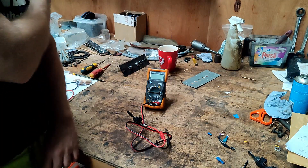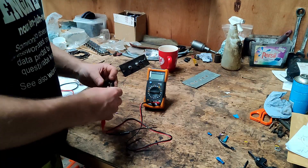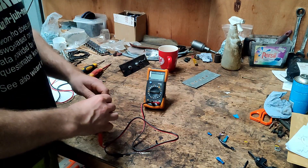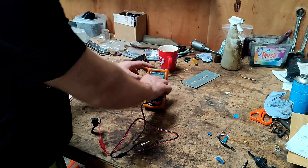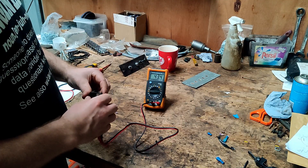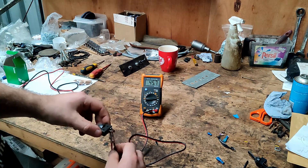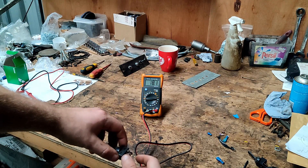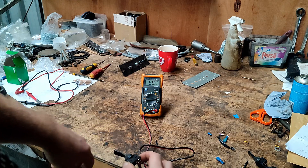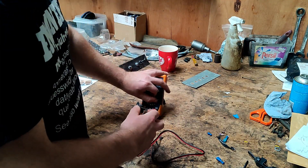Another thing I want to go over — that was supposed to be in part one but we'll do it now — is testing of switches. I recommend replacing all old switches, but even new switches you want to test them before you put them on. Some are very difficult to get at. The way to do that is we're going to take our multimeter, put it on ohms, or you can get an ohmmeter if you prefer. Connect this up and you can see the resistance is dropping down. Close the switch — there we are — we have resistance, so that's going to be off, and that's going to be on position. Simple as that. I'll turn that off.